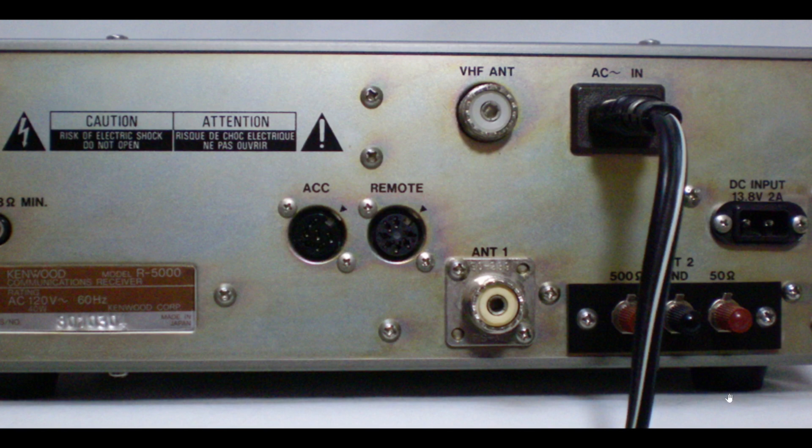The little screw or spring-loaded type connectors are meant most of the time for wire antennas that come in directly to the radio. Wire antennas have a very, very high impedance. Any type of antenna has a certain impedance, measured in ohms. Depending on how it's designed and constructed, it varies a lot. The typical SO239 connector is usually made for 50 ohms, which is kind of a standard. On VHF and UHF, there are a lot that are based on 75 ohms also.